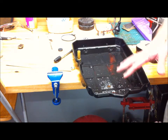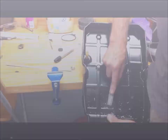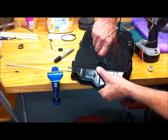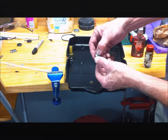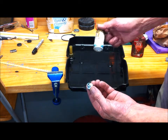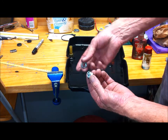The plug fits through the hole, so now I'll tidy up all the swarf and remove the burr on both the inside and outside. I've taken the burr off the outside — it's all smooth now — and cleaned the swarf from the inside. To install the plug, I take the nut off, place the washer on the bottom, apply some non-hardening sealant on the washer, and put some Loctite on the threads because we don't want this coming loose.